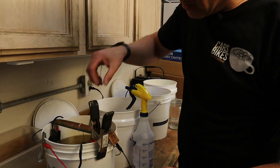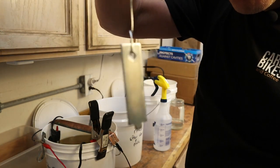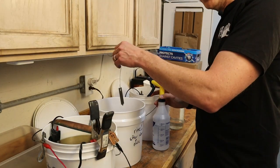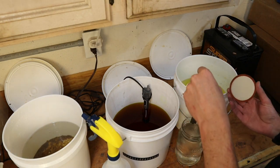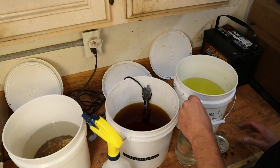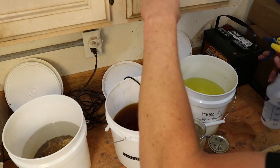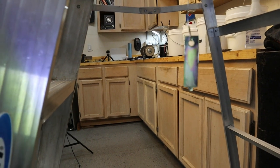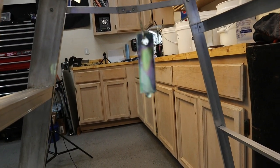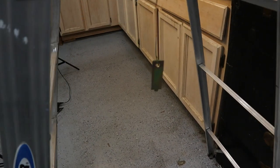We've gone for our full 20 minutes and it's looking pretty good. Turn off the power supply, take it to the first rinse bucket using distilled water and spray it down. Take it to the clean muriatic acid and dip for three seconds — that gives it a nice brightness. Then go right into the yellow chromate for 15 seconds. Then bring it to the second rinse and spray it down. Hang it up with a fan running, and as it dries you'll see it get that yellow, gold, green, and blue iridescence. Let it dry for 24 hours without touching it so we don't affect the yellow chromate.